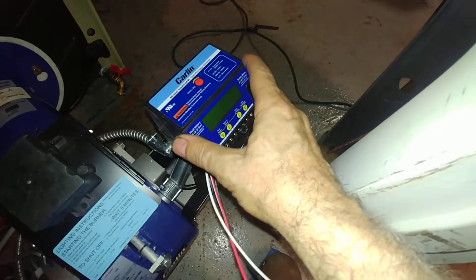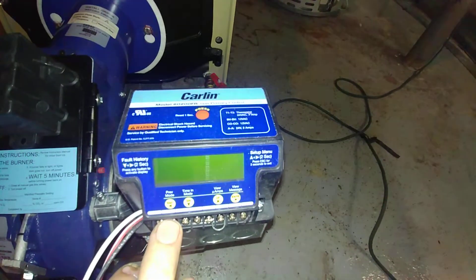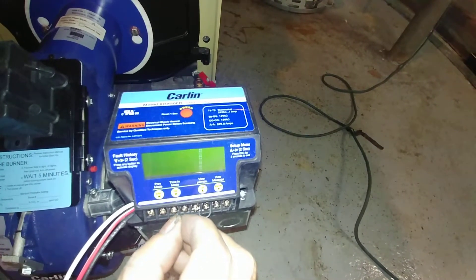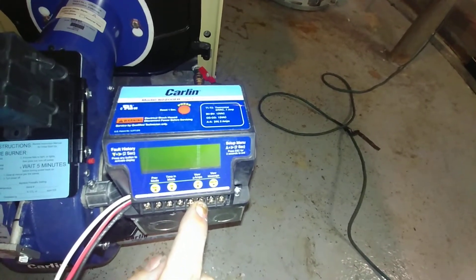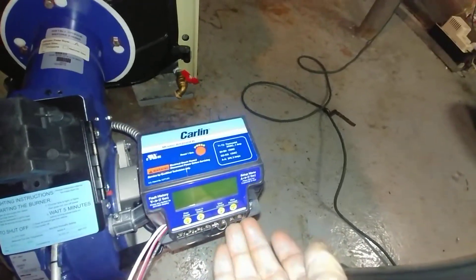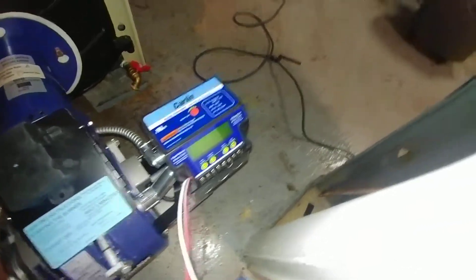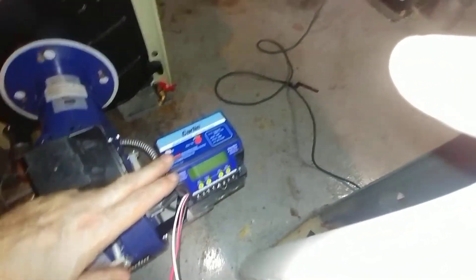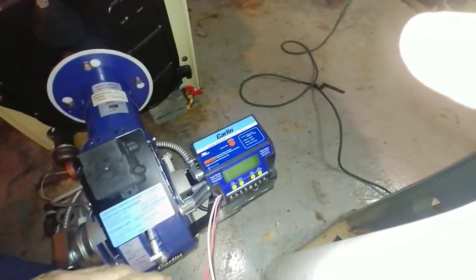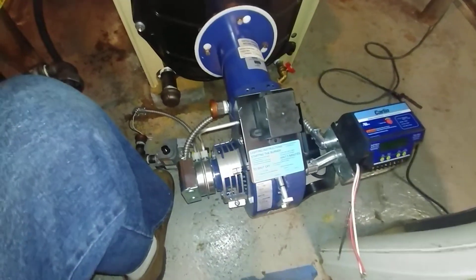These primary flame safety controls are becoming more and more complex. We've got TT terminals here, and this is where the blocked flue switch goes in. There are even terminals for carbon monoxide alarms and terminals for alarm systems. There's already a jumper on the carbon monoxide detector as it comes from the factory. These things have a lot of bells and whistles, and this seems to be the industry trend — to improve the information sent out to the installer and the user so we can better identify any problems and solve them.